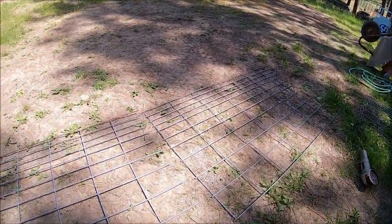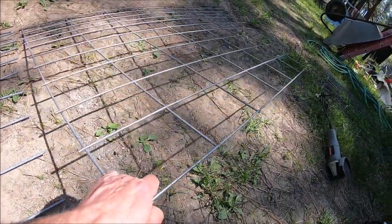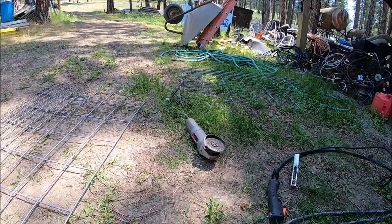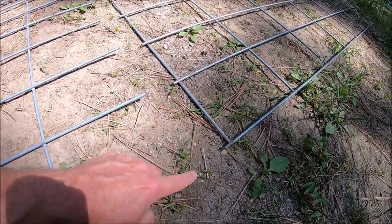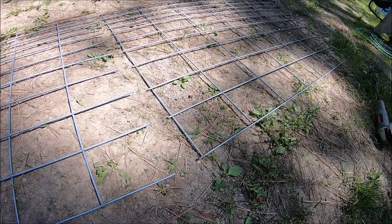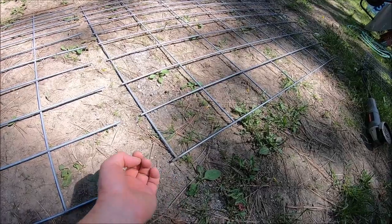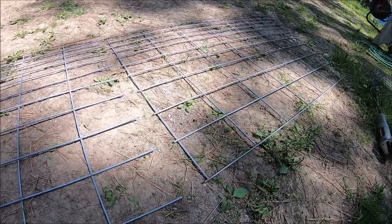So, and you can see these leftover panels here. We got one here, another one here, and there's one more laying over there. And so first we use our old trusty little 4-inch Craftsman grinder, and we prepare the two edges so that we can actually weld, not just around it, but we'll shape it at an angle, and this at an angle in, and then we can weld inside that V.